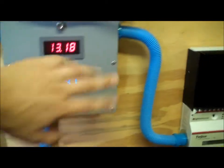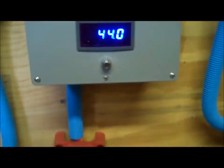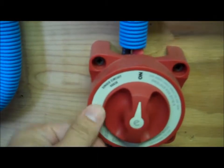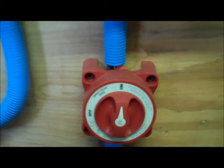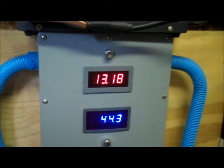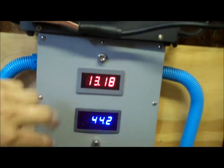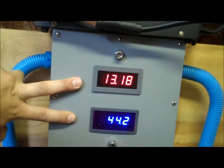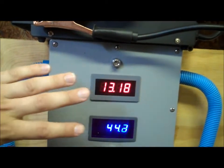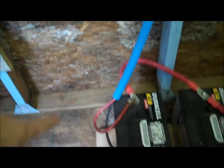This is part of our DC circuit. You have a positive and negative, and this is an emergency shutoff switch — the red one — where I can turn the whole system off so it doesn't charge the batteries. The solar panels from outside are going through this right here. This is a combination of wind and three strings of solar from the Sun Solar and Grape Solar panels, and that circuit goes down to the batteries.